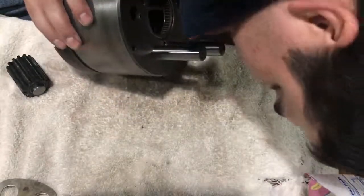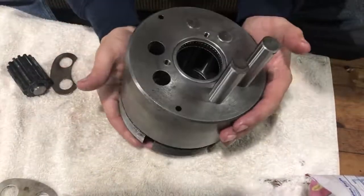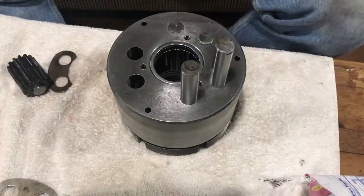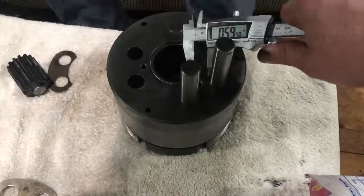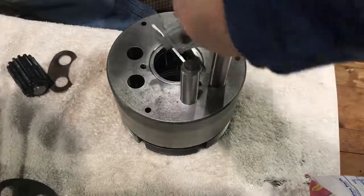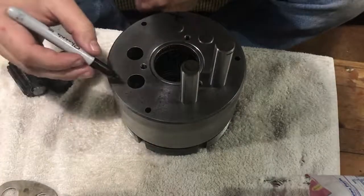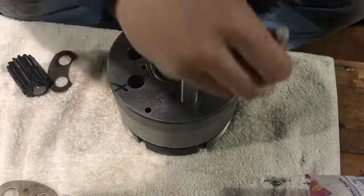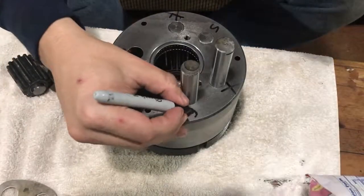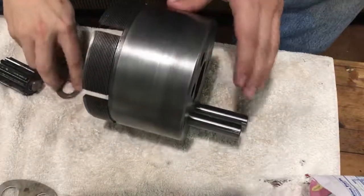What I'm doing here is adding an extra pin to the short shaft hole to hold the thrust pad in place so it doesn't fall out. Also, make sure when you're putting these in that the holes — the pair of holes — are offset. One is closer to the center and one's farther away. I didn't pay attention to that when I assembled the first one and had to redo it because I put it in the wrong hole. The long ones are farther away, and I simply marked them with an X. For redundancy, I put an S for short shaft on the inner hole. So just be aware and pay attention to that when you're reassembling these.